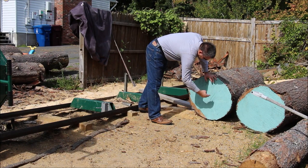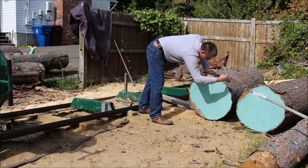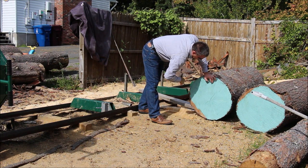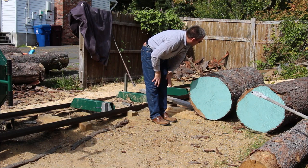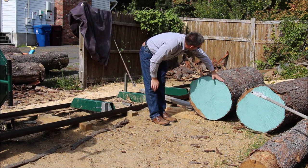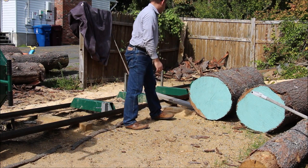If you can, you can get the most out of the grain if you orient it this way. You want to cut this way if possible — more important if you're cutting quarters off. It's an oblong kind of shaped log. This is a fairly flat side, so I want to make my first cut if at all possible with this side down. That way it's most stable.